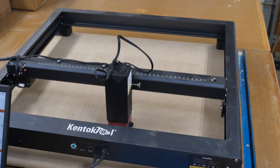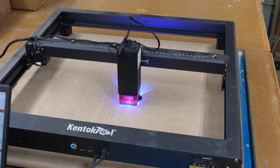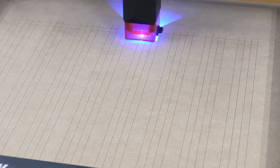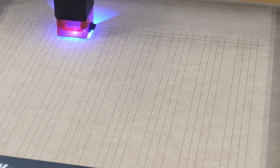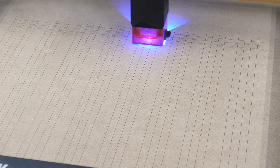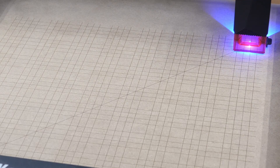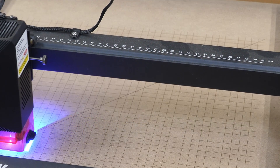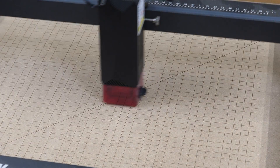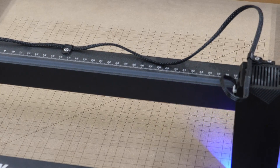You may think it is skipping lines, but it is not — that is where the next layer of darker lines are. They are spaced 50 millimeters apart in both directions, which helps when you're doing layouts. These diagonal lines are very handy for layouts as well. As you can see, this will be a darker line as we start on the next layer. If the lines aren't dark enough for your preference, you can run it again or change the settings before you start — do a practice run on a scrap piece.